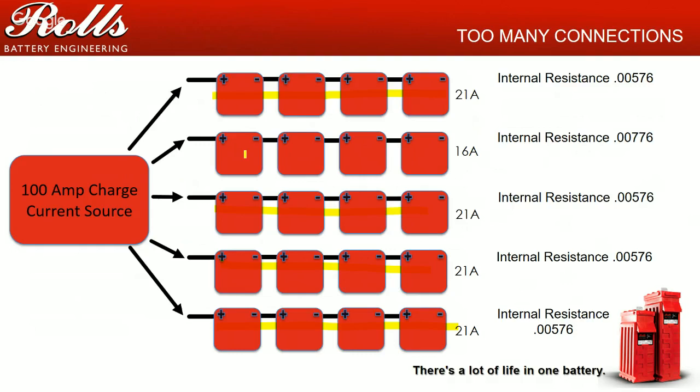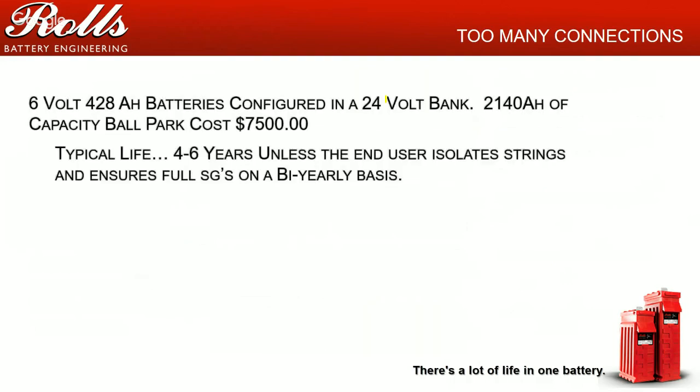Now, the problem is that during charging, once the charger goes away, well, there's twofold. Once that charging source drops, now string two feeds off of the rest of the battery bank. And that's not a good thing for the batteries in general. The other issue is with voltage control chargers: say you've got higher current going into the four parallel strings, so your voltages go a little higher on those, the voltages get to bulk and absorption faster, that tricks the charger into going to absorb too quick, which means your batteries never see a full charge. So it's just a problem that will perpetually cause a problem.